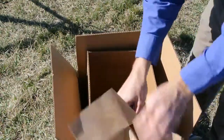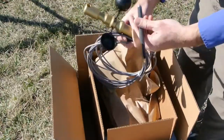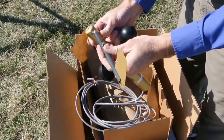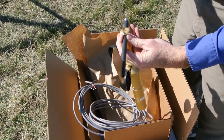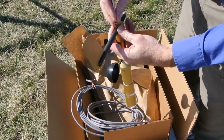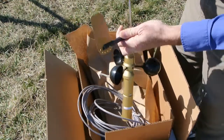The next sensor in the box is the wind sensor. It has a 20 foot cable attached to it. At the bottom of the box is the vane. The vane attaches so that it goes in on the side with the set screw. A number two Phillips driver is used to remove the screw that secures the counterweight and the stem. Line the holes and tighten the screw.